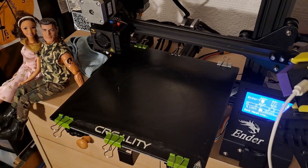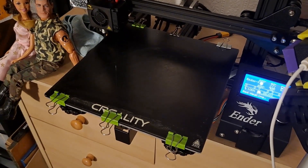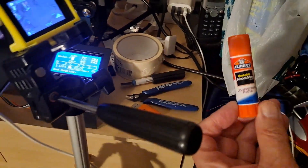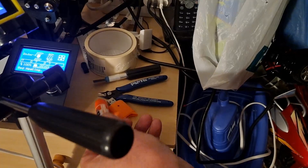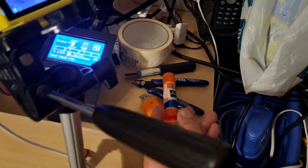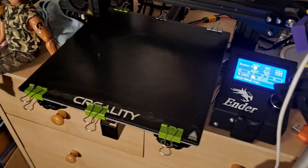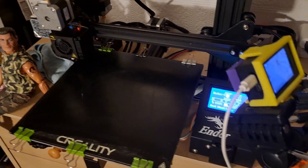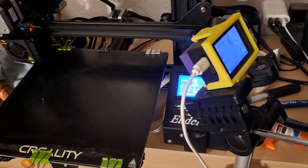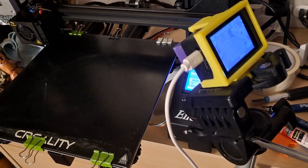Main point I did pick up was it does stick to your build plate. Various ways of curing that - I've covered it with Elmer's glue, which should help me release it afterwards apparently. Another way is using masking tape, but I thought I'd try the Elmer's glue first. Print temperature, I'm going for 220 at the moment, which is actually less than I've been using on the purple PLA Plus. But I've dropped the bed temperature to only 60 degrees.